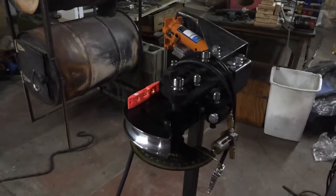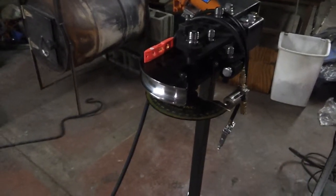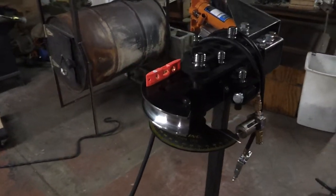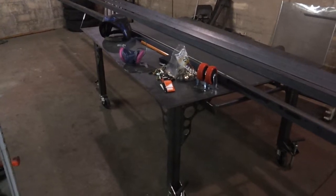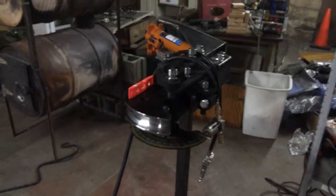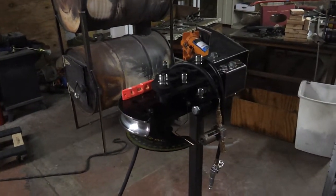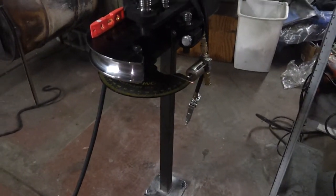Some people run their air over hydraulic on carts that they can wheel around their shop. I thought about doing that, and the more I thought about it, the more I opted out — just for this purpose alone. If it's level, it's like having a nice level welding table: you can use that level as a tool because you know that whatever you're building has a nice level base to work from, instead of having to compensate for it. So that's why I chose to go ahead and anchor this to the floor.